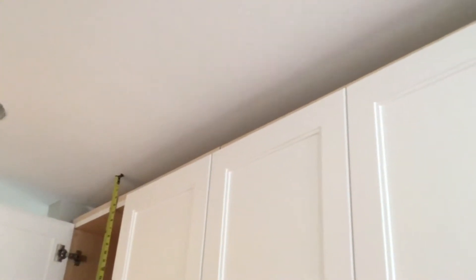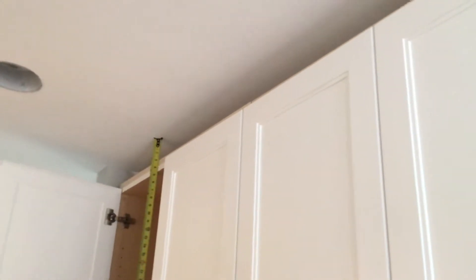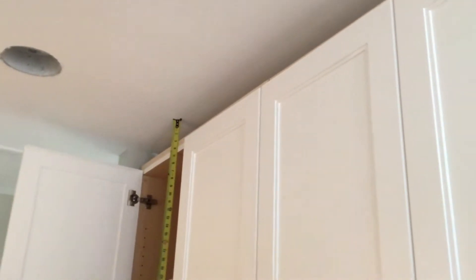When you come down here, you need some kind of a transitional piece for the floor and a piece for the top. This needs to be a square molding from the drywall to the beginning of the edge band — it's a hair under four inches, like three and seven eighths. So you need some sub crown here, no crown, and it needs to be furred out to be flush with this.